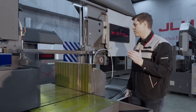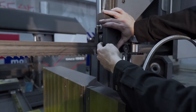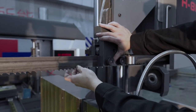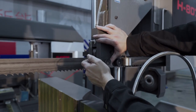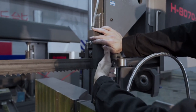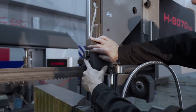Zooming in more to the guide seats, we have a 54 millimeter blade, tungsten carbide inserts, 1.6 thickness. Sorry, forgot to say, it's important because we have two varieties of that blade. Carbide tungsten inserts on the front and on the back. Again, manually settable because it's a bigger insert, manually settable with two manual screws. And on the top, a carbide swing principle pressure block